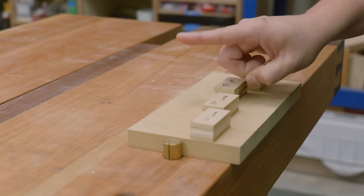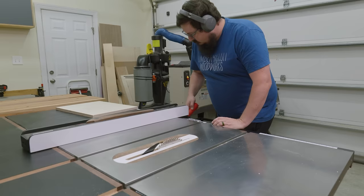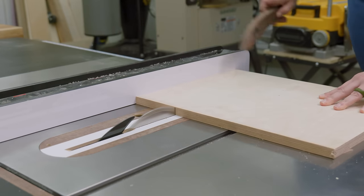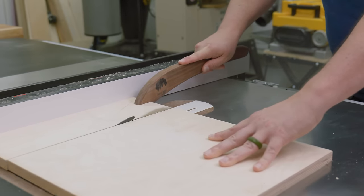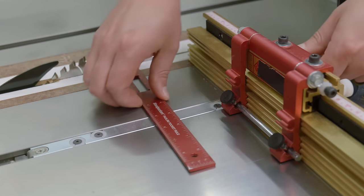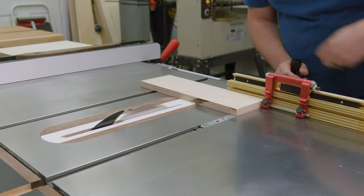The first thing I want to address is this blade registration jig. My existing one is super bulky and I know I can do a lot better. So the first thing I do is head over to the table saw and cut down a piece of Baltic birch plywood. The reason I'm using Baltic birch rather than regular plywood is because it has a lot more layers of lamination, which means it should be void of voids.